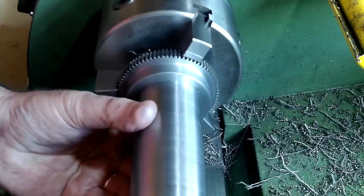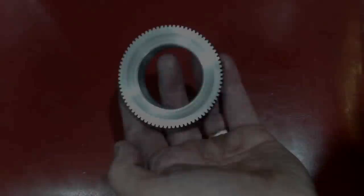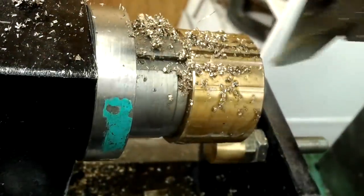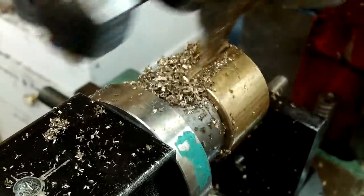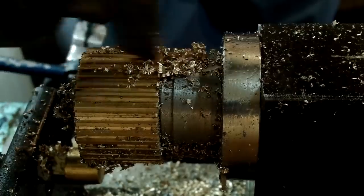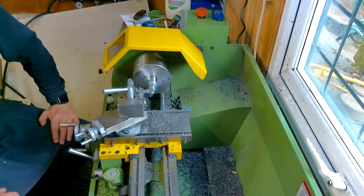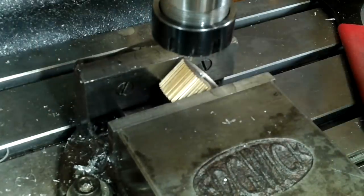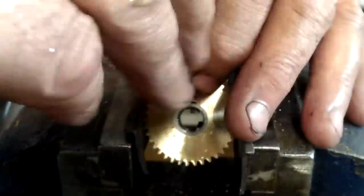The bore was finished to fit over the advance tube and it will also get a 4mm tapped hole for a grub screw to lock it onto the tube. This is the smaller of the two gears — the process it went through was the same as the larger gear. It's made of brass because this material was already at blank size sporting a 14mm bore. All it needed was shortening and a keyway in the bore. As a brass gear, it should allow both gears to interact as gears do, as well as slide longitudinally together. Here I am making a reducing bush to be pressed into the brass gear — this bush is drilled and finished to allow fitment of a 10mm diameter bar. In order to aid assembly and disassembly, I need a grub screw arrangement. As a temporary solution for now, a circlip and keyway would be a better solution after tuning and testing.